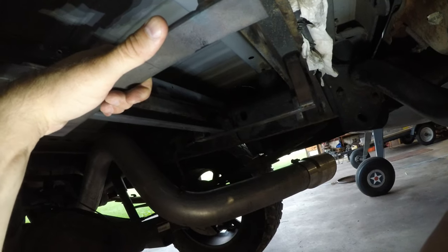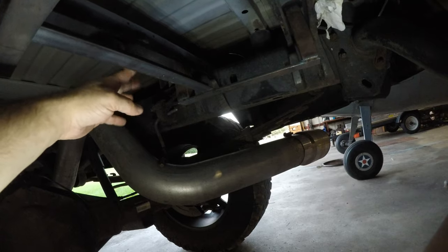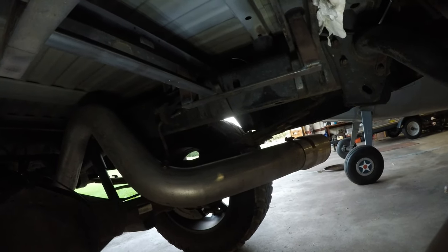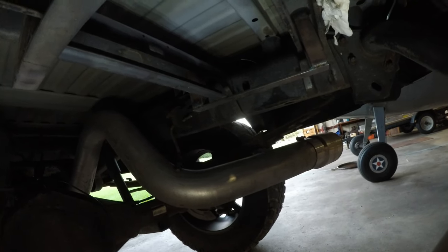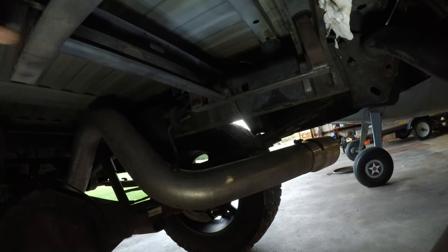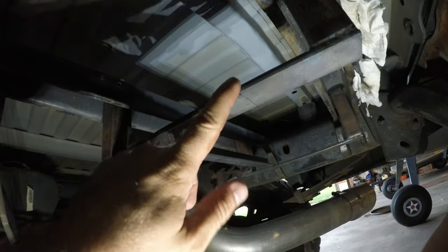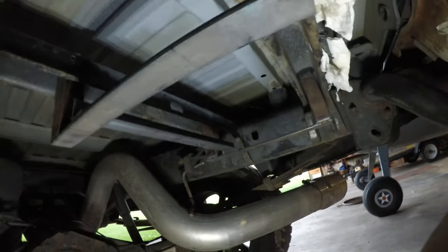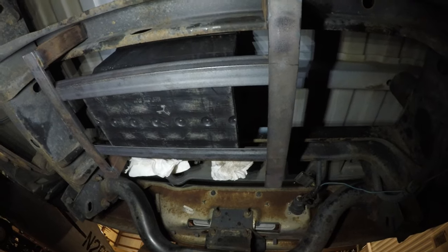I'll see what I can do about a hold-down - I think I'll just weld a couple of tabs on the side and hopefully run something down that way or use a bolt. I've got them marked on where I'm gonna put the battery - these are the outsides so I just gotta weld them there and everything should be good.